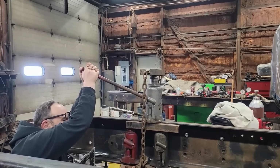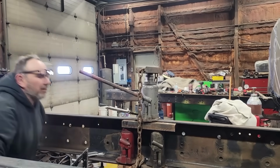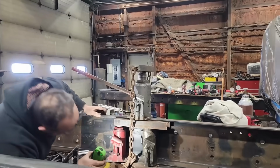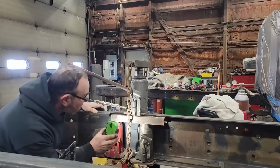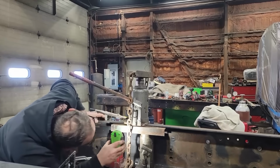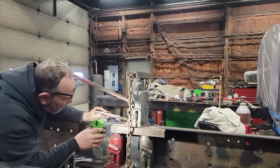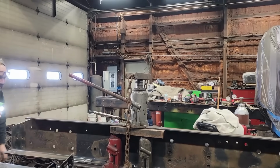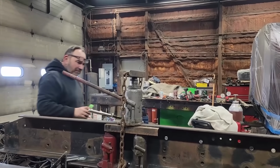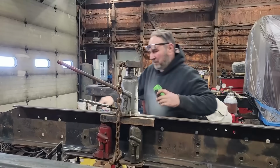On the bottom frame rail, there are 2 pieces of 1/2 inch thick 4x6 angle iron. And then there are the 2 bottle jacks, and you see that 4-inch piece of C-channel on top of the 2 bottle jacks. So there's a piece of 1/2 inch plate under there. What those 2 bottle jacks and the 2 pieces of angle iron on the bottom are doing is keeping the top rail and bottom rail from just collapsing on each other. We want to maintain the distance.